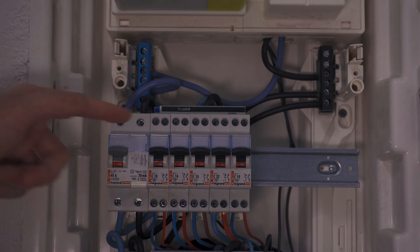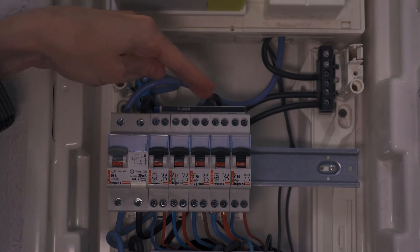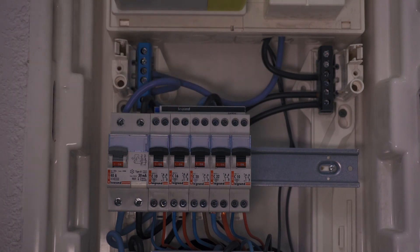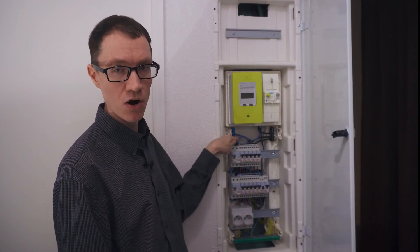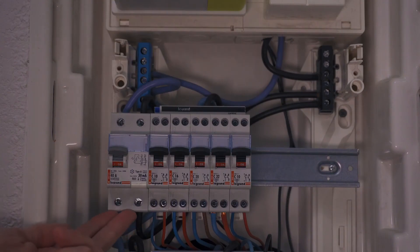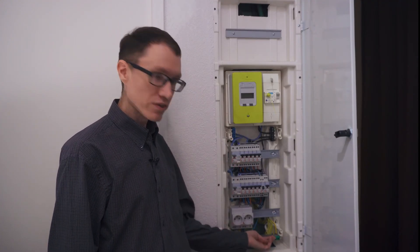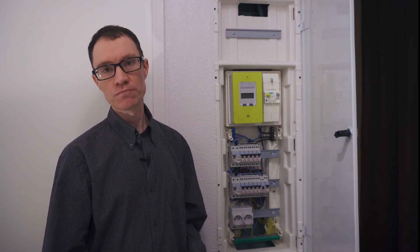Each of these circuit breakers, although it has only one switch, is actually a two-pole breaker. If you look carefully at the top, you can see two little holes — the left one is labeled 'N' for neutral and the other is for hot. Two bus bars run along the top of these switches, distributing neutral and hot from the safety device to every single breaker in the bank. Below each circuit breaker, you can see two wires — hot and neutral — plus one grounding wire attached to the earth bus bar, giving you the three wires needed to distribute electricity to any socket, light fixture, or appliance.